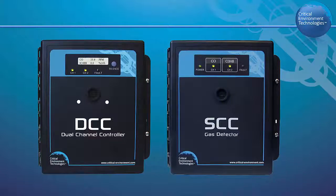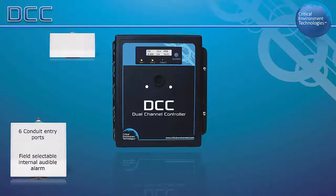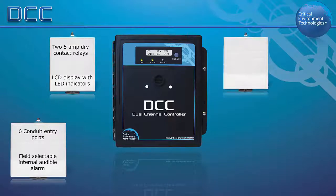The DCC has 6 conduit entry ports, a field-selectable internal audible alarm, 2 5-amp SPDT dry contact relays with field-configurable time delays and trigger levels for control functions, and an LCD digital display with LED indicators for power, channel alarm status, and fault conditions. Configuring the settings for the DCC is done through an easy-to-navigate, password-protected menu structure.